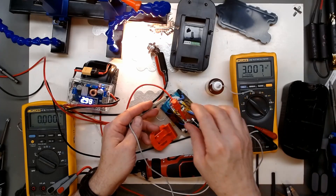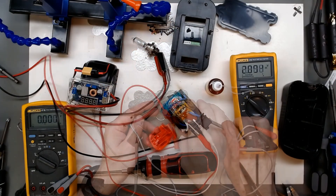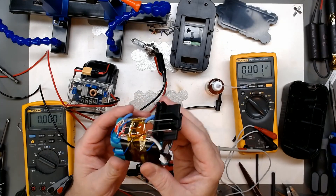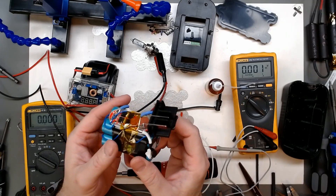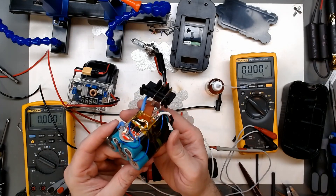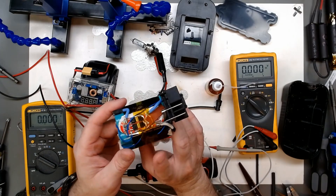I got my lowest cell here and dropped the charger off from charging briefly - it's at the cutoff point. We see we hit 2.7 volts and the BMS does cut the pack off. We got one cell that's dropping off a little before the others, and that's because I did not balance them out very well when I charged them last time. But they were within about 0.2 to 0.3 volts of each other - good enough for that test. Pretty satisfied with the BMS on the discharge.